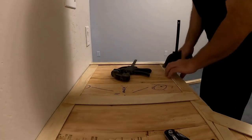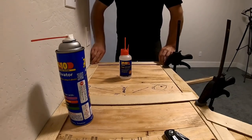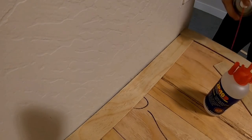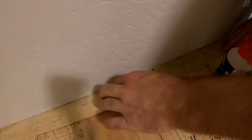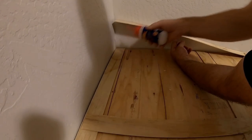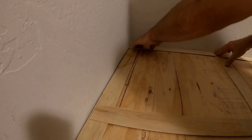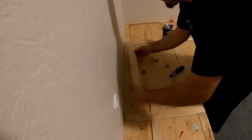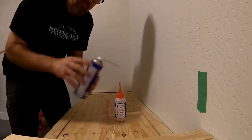We start on the big countertops first, then work our way to the little ones. I'm holding that front edge in place, then gluing the last piece and looking for gaps. Where there's a gap at the wall, I use cut-off scrap pieces to show exactly how tight I can get to that wall, filling in pieces until it's snug. On this particular job, we won't have much backsplash to cover the walls, so we want to be nice and tight.